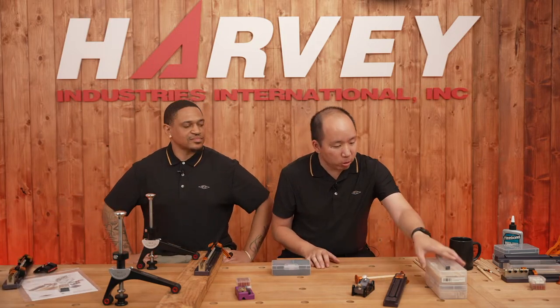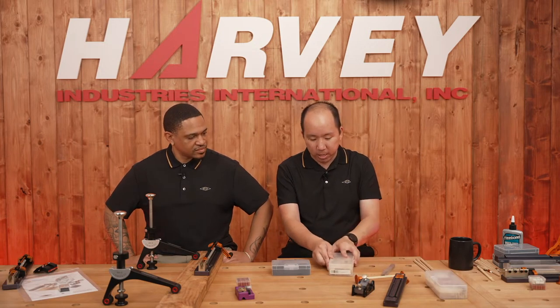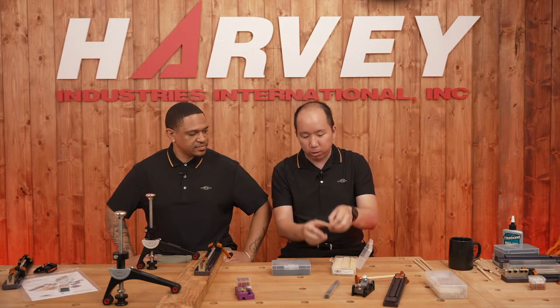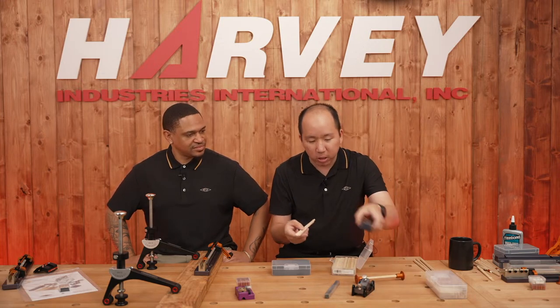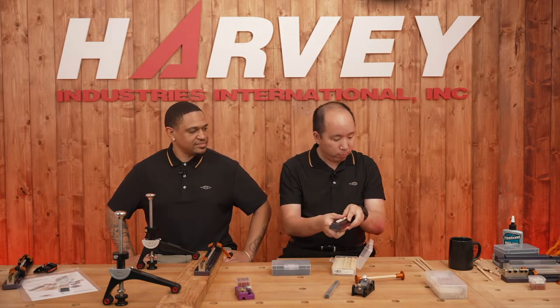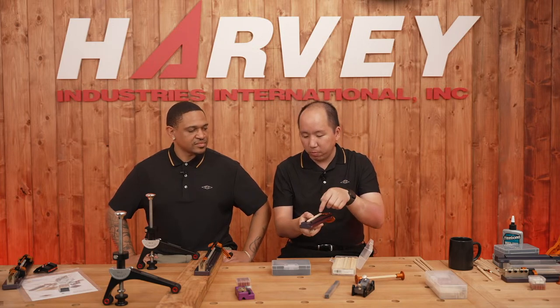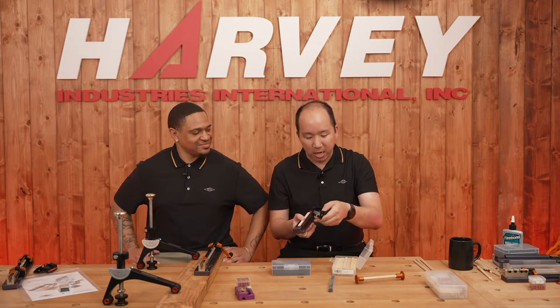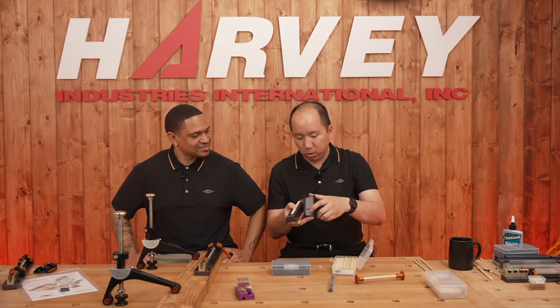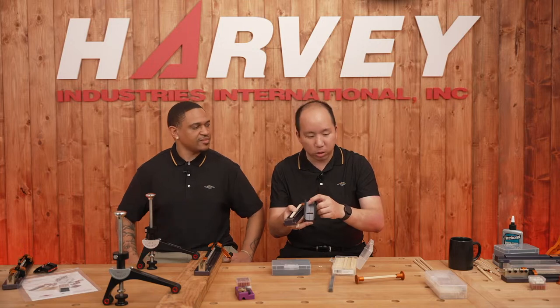Doing a quick recap, by the way. We will start with the pencil lead. Set that aside. First step, as we mentioned earlier in the stream, we take two pieces of blanks, and we use this jig to hold it down and profile it to cut the little grooves in the middle on both pieces, with our special plane here. It looks very similar to the HP8, but it's not. It has a little special groove here for cutting out to install the lead.